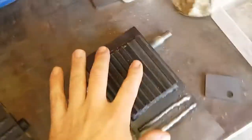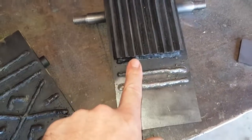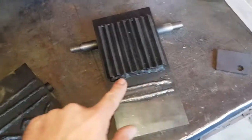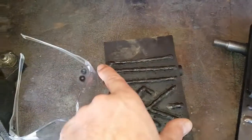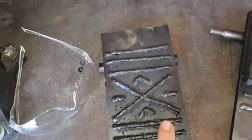I'll just show you these jaws. We designed these jaws so that if you wear them out over a couple of years, you can just grind this off and order some new jaws, run a bead along here. And same with these hard-facing teeth — you can run another bead straight across the top, or grind them flat and put some new beads on.